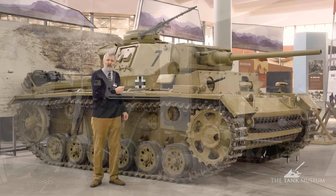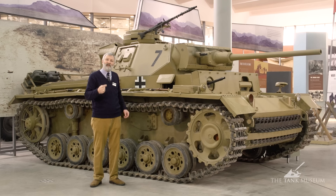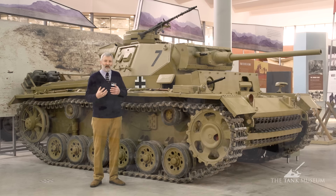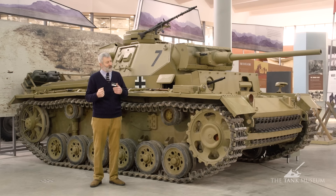They thought some technical details were a bit over-engineered for what they were doing. But one interesting worry they identified was the welds. Even though the Germans had come up with this method of welding armour plate, those welds made the tank fairly vulnerable at certain times — if the welds weren't up to scratch, that was where the tank would tend to split if hit. Looking at images of internal explosions, quite often you'll see cracks going along the seam lines of the welds.